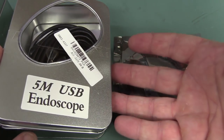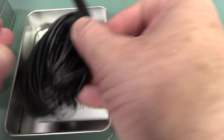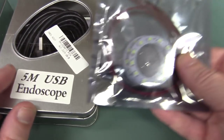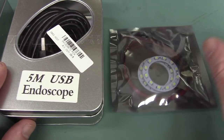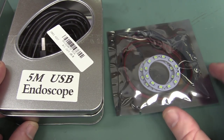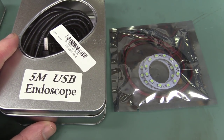As far as the camera vision system goes — just cheap as chips USB endoscopes that you can get on eBay for next to nothing. We actually get two of those, so there are going to be two cameras on the thing. We've got some LED rings as well — they look much bigger, so there must be some sort of mount to plate all this jazz on. That's all you need these days — it's easy and cheap to add vision placement to a DIY pick and place machine these days. Wasn't the case like 10 or 15 years ago.